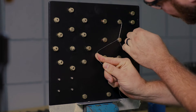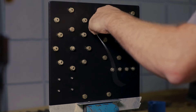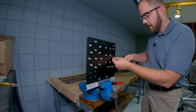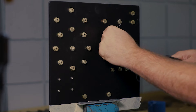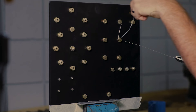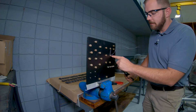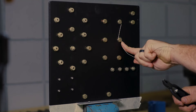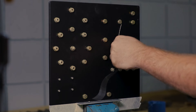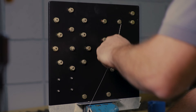Now I know I need about one more half twist, which gets me right at the bolt hole. Run the wire through. I like to use my pliers to pull it nice and tight, and also make sure this lays down around the bolt head. Sometimes this will want to try to pop up over the top of the head while you're doing the next one. There's two ways to do this — you could come around this way, or I could pull it 180 degrees and come around this way. Either way works. However, in my opinion, one is better than the other. If we take this wire and turn 180 degrees and try to come around, you can see how we get a really ugly loop and a kink right there. But we can do it that way — we'll go ahead and do it that way so you can see it. If I take that wire and pull it tight, it's kind of ugly, but that does work.